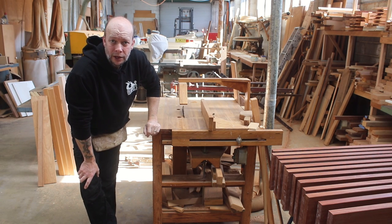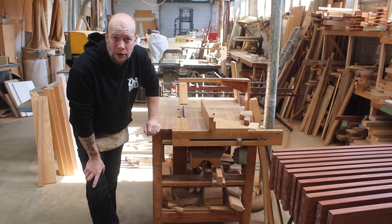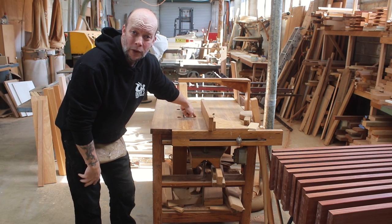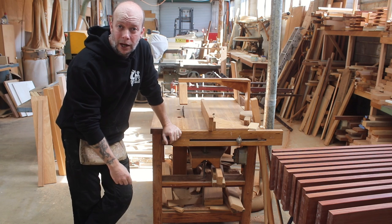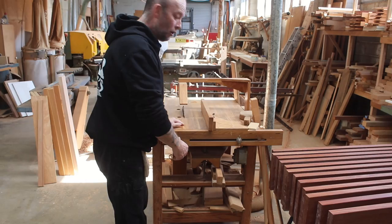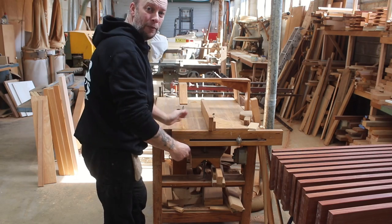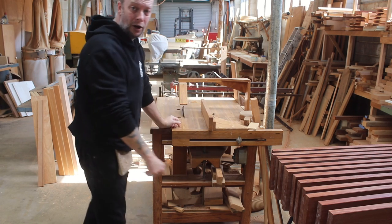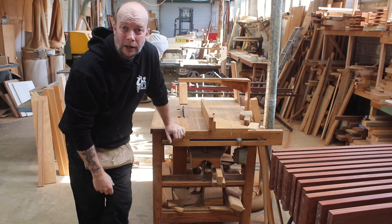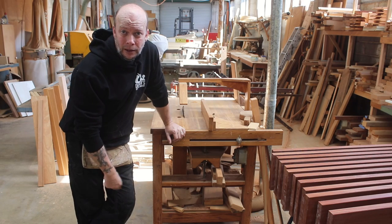One very important thing to consider is when you're using the machine — whether it be a rip saw or a sliding table saw — it is extremely important where you stand. If you're ripping timber, especially small bits, the rate at which timber can fly out through the back of the machine once it's been cleared can shoot like an arrow coming out of a bow. So you never ever stand directly behind — you always stand off to the side. When you're ripping timber, stand off to the side so anything that ejects, ejects to the side of you. It doesn't come straight into you, and it will pierce your body. If you're standing behind it and it ejects — say you're ripping a 10mm slither or a 3/8 of an inch slither — it'll ping it out like an arrow and go straight through you, make no mistake.